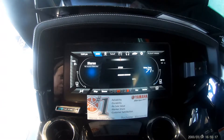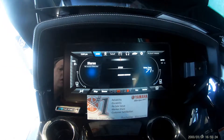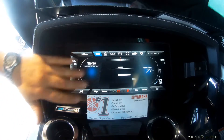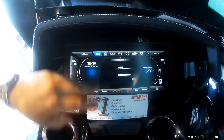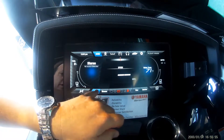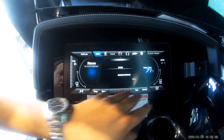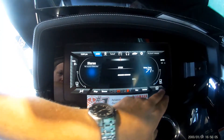The various options are stable around the border, and you've also got your obvious indexes up at the top. We've got our clock, fuel gauge, depth gauge, and float mode. Float mode throws people for a loop a bit — it's really just a slightly different set of information more pertinent to when the boat is not running. When we fire the boat up, some of this will be replaced by a tachometer and other things. In float mode we've got stereo control, water temp, battery voltage, compass heading, and warning lights at the bottom.